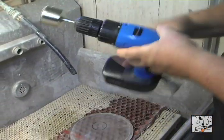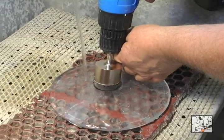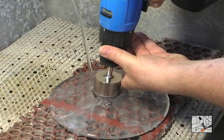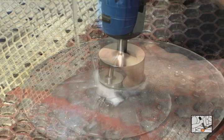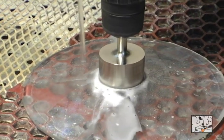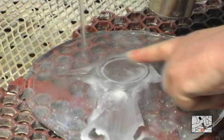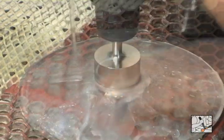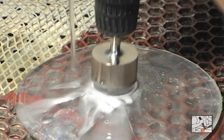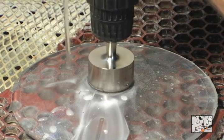First will be the handheld method. I'm going to go in, not straight down at first, but at an angle. I'm doing a slight rocking motion. You can see it's begun — it's pretty much within my ring. Occasionally up and down, letting the water carry the ground glass away.